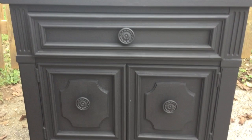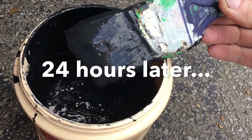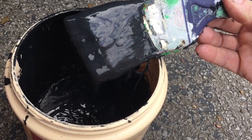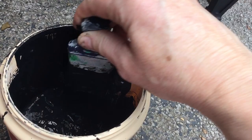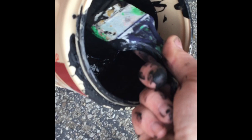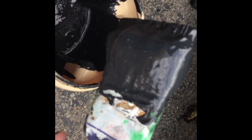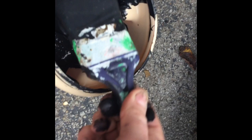This is the lime or calcium carbonate paint. I see little pieces of stuff in here that I believe is lime that has started to clump together, but I think if we mix this again and add a tiny bit of water it will be fine. This is the Plaster of Paris paint that's been sitting overnight. It has gotten thicker, which could be fixed with some water, but we can see some bigger lumps starting to form. These lumps are more difficult to get out because it's actually started to harden and form plaster. We'll add a little bit of water to this and mix it up and see what it's like.